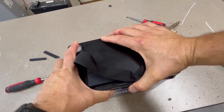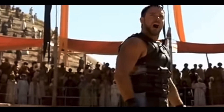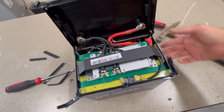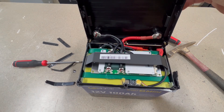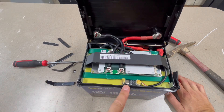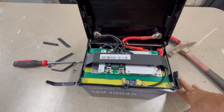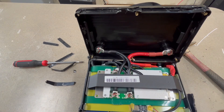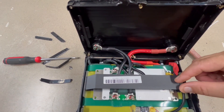Not an easy battery to get into — I even nicked my finger. Doesn't look like I ruined anything inside. This is IP65 rated, I don't think I mentioned that. They used what looks like rivets or some kind of screws to hold the case down, which is why it was not easy to get apart, and there is absolutely no extra space in this case — very, very tight. They actually have a little structural bar over the top of the BMS to give it space and protect it, which is pretty neat.